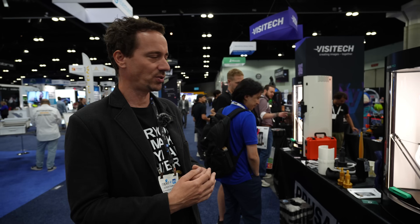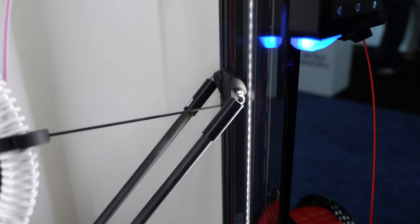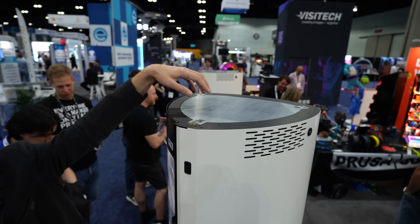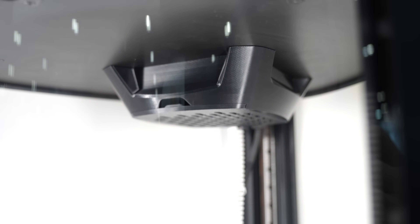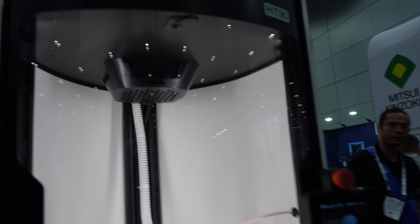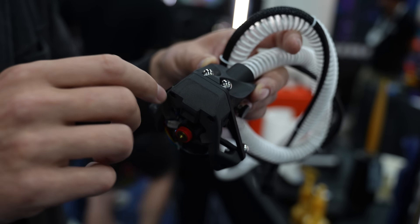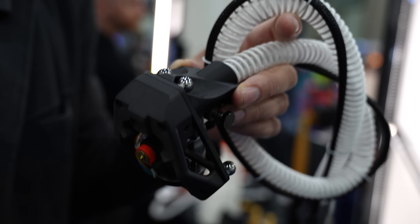With the HT90, we came up with a brand new cooling system. As you can see, there are no fans on the printhead. It's something like a turbine, which is not within the chamber — it's outside, in the upper compartment. What the turbine does is suck in the hot air through a HEPA filter, which ensures user safety even in an office environment. It then forces the air back down via a dedicated tube to the printhead. The air serves two purposes: it cools the printhead itself like a heatsink for the hot end, and if we want, we can use it as a layer cooling fan to cool details like overhangs and bridges.